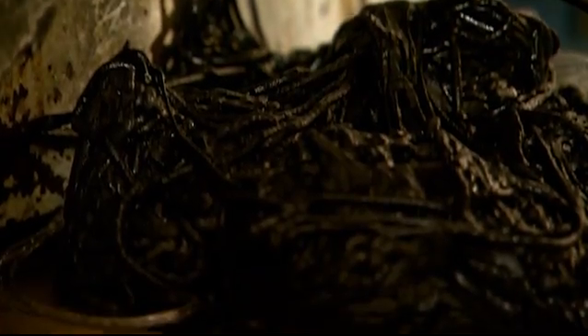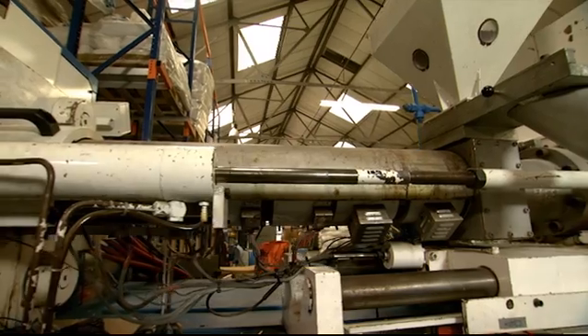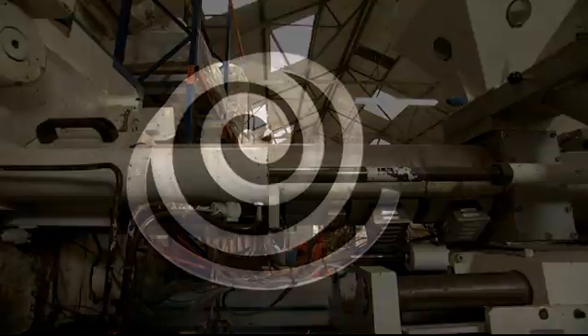So make sure you shift all that high temperature resin, then process the EVA at a gentler temperature. We've finished the nylon — now we'll run the Barrel Blitz Universal through at those temperatures, then drop the temperature to the EVA processing temperature, purge a bit more Barrel Blitz Universal, then straight into your EVA.